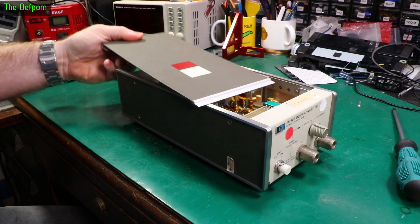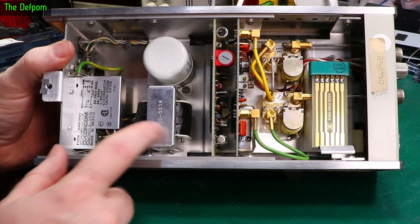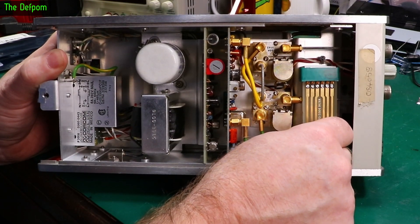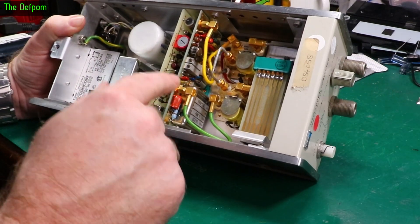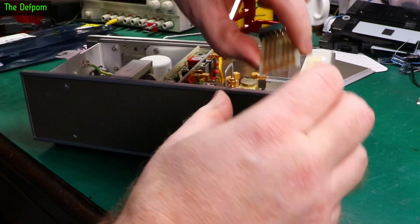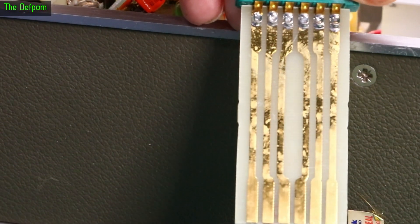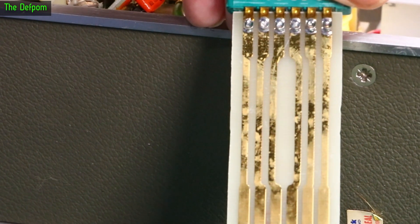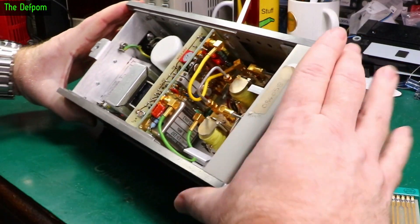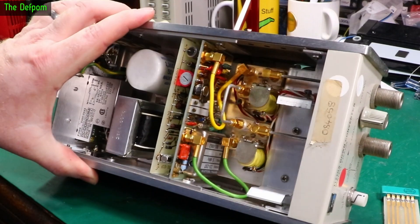So this was from the local Navy, I suppose. Inside there's not a lot — a capacitor, transformer, filtering, some kind of card here which is interesting. It's got a riser card in there; if I need to lift this board out, there's a riser card for it. I can actually see tarnishing on this. Gold doesn't tarnish, right? Well there you go — there's tarnishing on that gold. Gold definitely tarnishes. We've got some mixers in here, a power supply board, and an oscillator there with some supporting circuitry. Lots of gold — gold-plated circuit board.